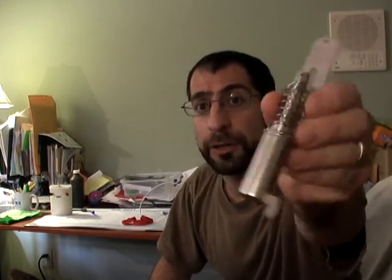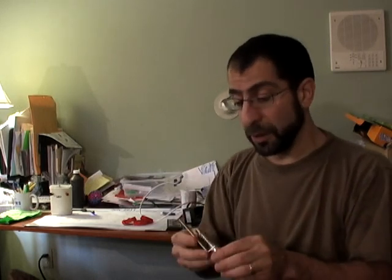So I went out and found some solenoids that were cheaper — only $1.50 each, and very similar. They're not identical; there are some physical differences, and they're only rated for a 10% duty cycle, meaning they should only be on 10% of the time, compared to the specced ones rated for continuous duty. However, for $1.50, you could buy a bunch of these before you'd lose money burning through them.